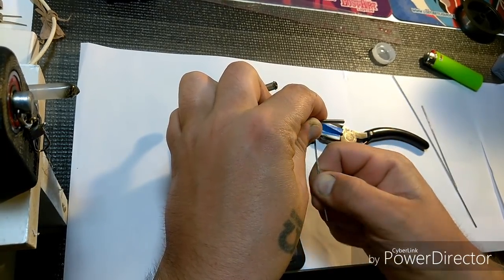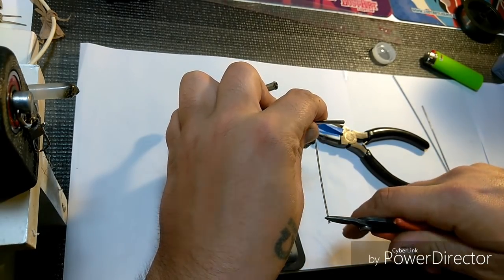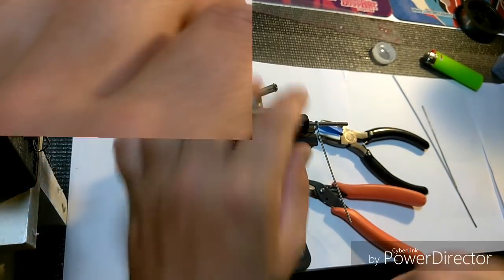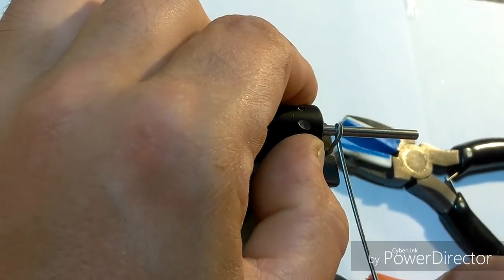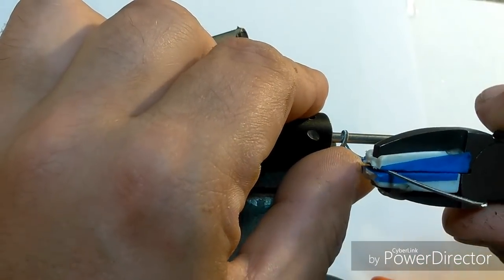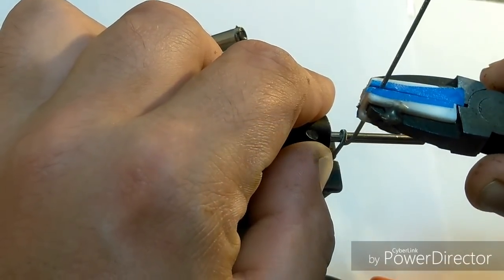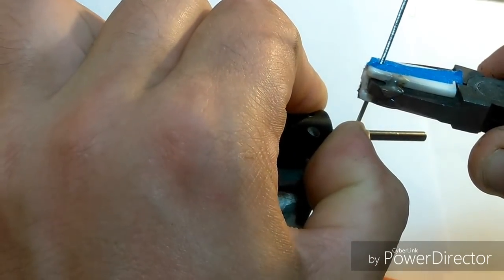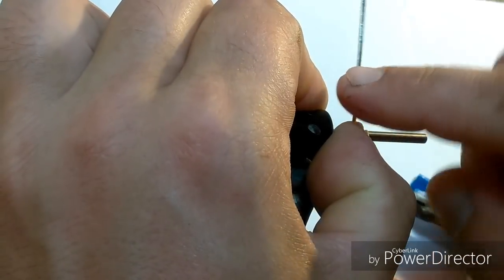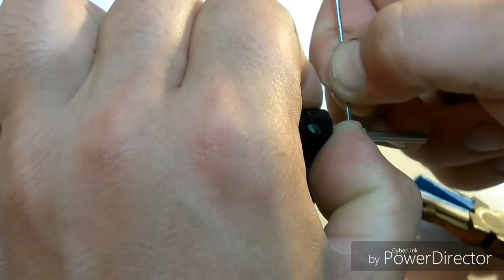Get it away from my vise. Bring it back. I'm going to take some needle noses. And I'm going to pull. Alright? That first wrap's done. Now, I'm going to bring my wire up. If my wire tries to spin on me when I'm bringing it up, spin it the opposite way. Spin it the way you want it. So I'm just twisting and bringing it up. And then I'll get my thumb there when I want it, where I want it. Then I'm just going to push it back down, but guide it by keeping my fingers close to the rod.